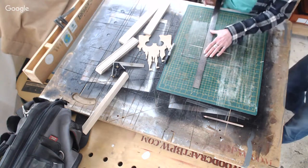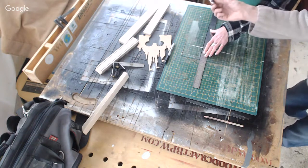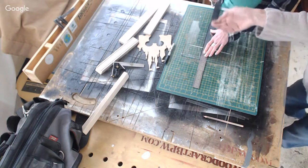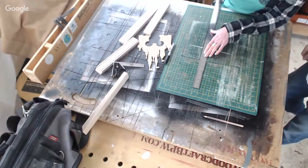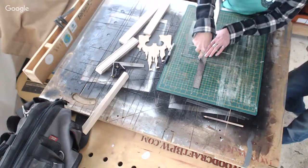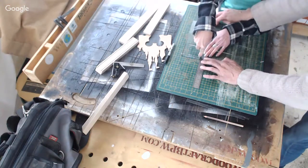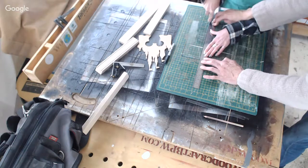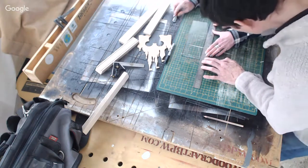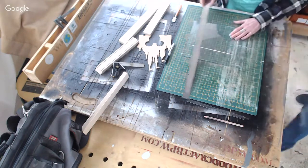Cutting glass is weird because you're taught as a kid to be scared of glass. I usually do it the other way around, have that against the ruler, but it doesn't really matter either way. So that little black nib is the cutting wheel, yeah. I'll hold this down a minute. Oh, so you've got to keep it against the ruler. So I think you've done it. I think that sounded quite nice. A few bits. Yeah, don't worry about that because that'll all be hidden in that little recess anyway.